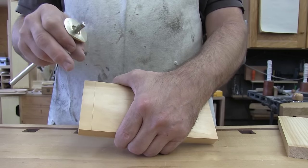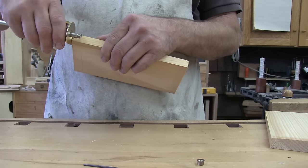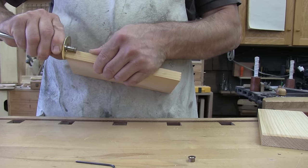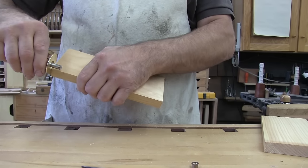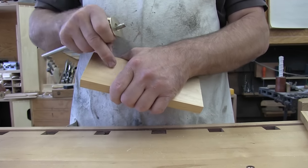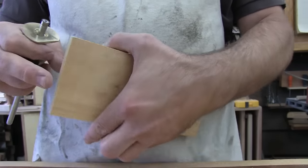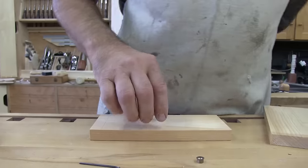Always best to test it in something soft. Soft wood will crush before it'll cut unless the blade is really sharp. I always like to roll the edges as opposed to pulling it across, because you have very little reference surface out there. You can go very light if you're working on the face and you don't want a marking gauge line, or you can actually go in and pencil in your dovetails — I'll show you what I mean.